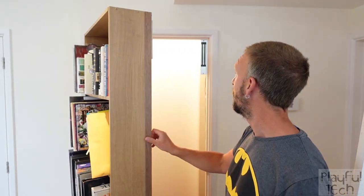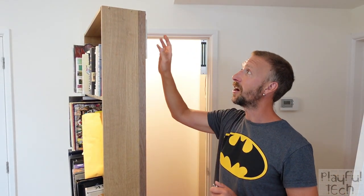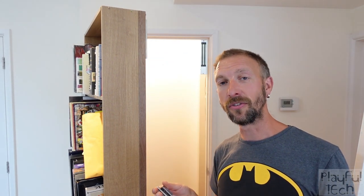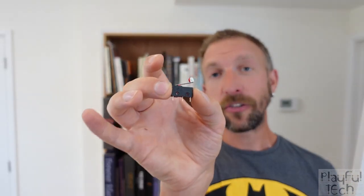For that reason I decided on a different approach and went for an electronic solution. The eagle-eyed amongst you may have noticed the mag lock I have secured on the door frame here and the armature plate on the inside of the door. These are going to be held electronically shut, and if there's any reason for the door to be released, the power is going to be cut automatically and the door will open. To control an electronic lock we're going to need some electronic switches.